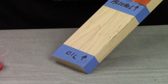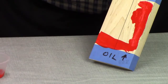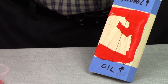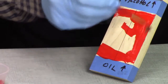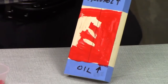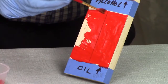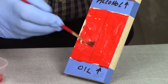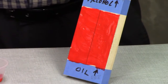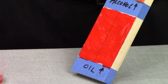So now come down here, and I'm just going to use one of the oils. So if a person wanted a red or a blue or a green turned item, go buy one tube of artist oils. The reason I chose oil is because I particularly use oil finishes on virtually everything I do. I'm not a person who does water-based polyurethanes and these types of things. Is not something that I normally do very often. And the beauty about it is, if I finish a lot of my products with Watco Danish Oil, so it enables me to, I don't have to worry about any incompatibility issues.